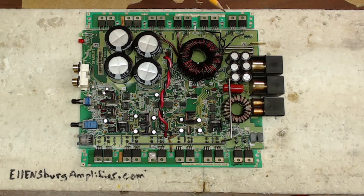I was getting a good gate drive on the power supply, which you can test on these amplifiers without having your B positive hooked up. If you have your ground and 12 volts to your remote, you will start your drive. That's one way you can check your drive to the transformer without applying voltage to the transistor itself to build rail voltage — you can test the drive with just the remote and the ground. I did have a really clean drive signal.